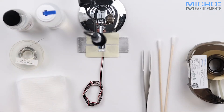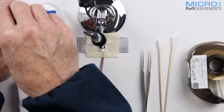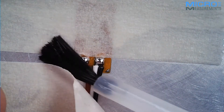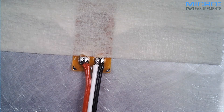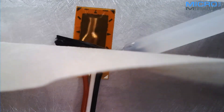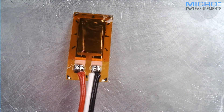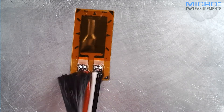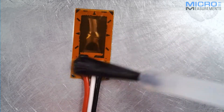Once again I'm going to go in with my soldering iron — a little bit of solder on the iron — and using one second I'm going to reflow each of those two solder joints to capture the wire in there. That's essentially the job done. Now I'm going to take a brush full of rosin solvent to remove the flux residue and the tape. The flux cleaner removes the tape very easily, being careful that the gauge doesn't lift off the surface too far. Then I give the gauge a really thorough clean, making sure to get the brush in amongst the solder joints and around the lead wire.